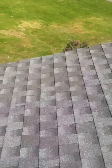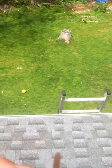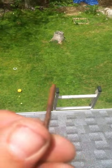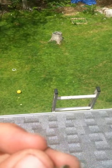We replaced all the flashings. The reason we're back here, beyond the plywood issue, is they also had a ventilation issue. If you look, you can see that the tip of this nail is rusty but the exposed part through the shingle is not — that tells you that the moisture was on the inside of the house as opposed to the roof leaking.